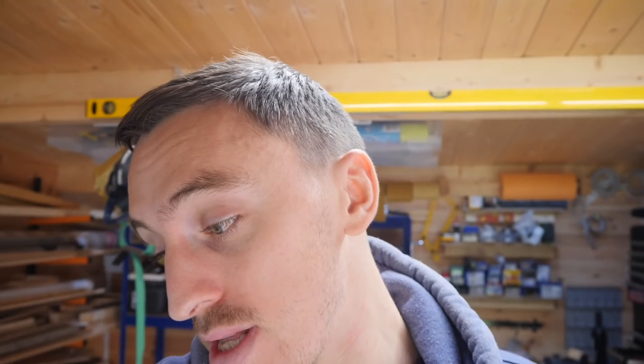The principle is exactly the same for the pillar drill as well. You can just clamp a jig to it, and because there's no other axes of movement, like the bench on the mill, which doesn't exist on the pillar drill, you just clamp it in place, make sure the drill point is in the center, and you just keep going up and down, up and down.